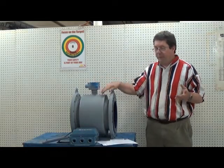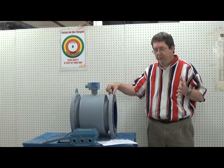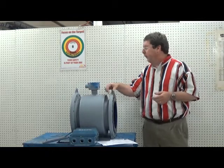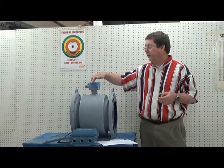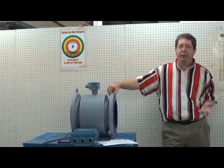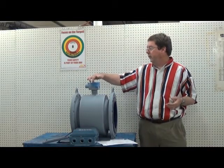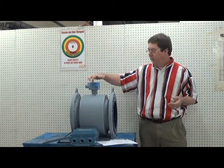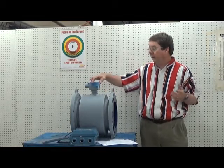One way to check a magnetic flow meter if you're concerned that the flow meter has an issue is to disconnect the one and two coil connections and use a megger — the same tool that an electrician uses on an electric motor. You touch the megger to one of the coil connections, one or two, and the other side to the pipe or ground or something that you know is a good ground.